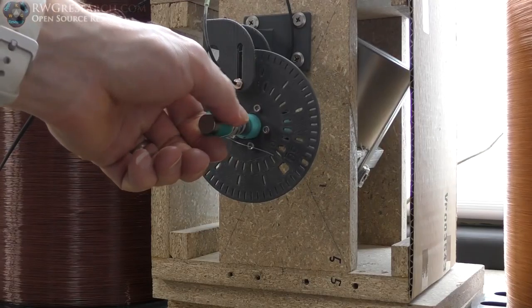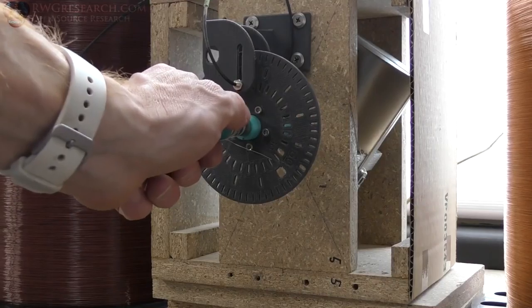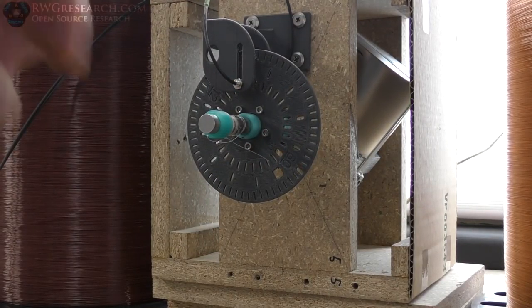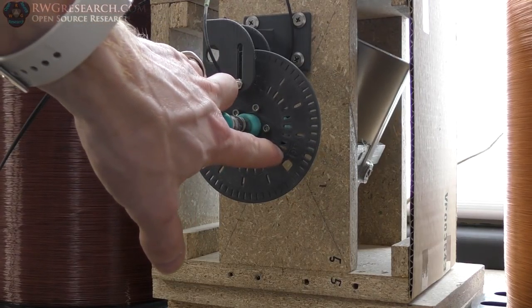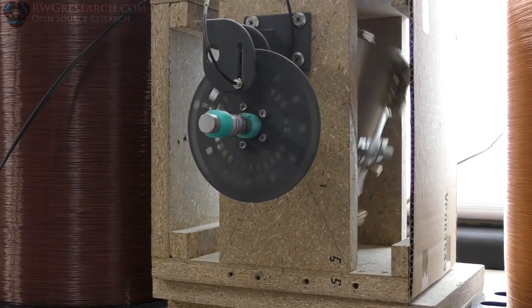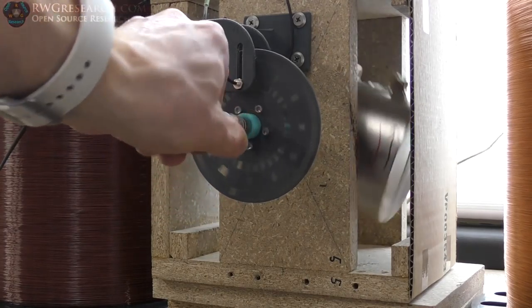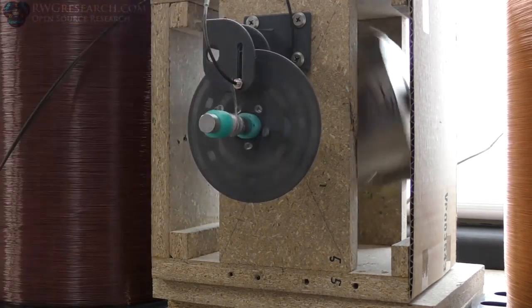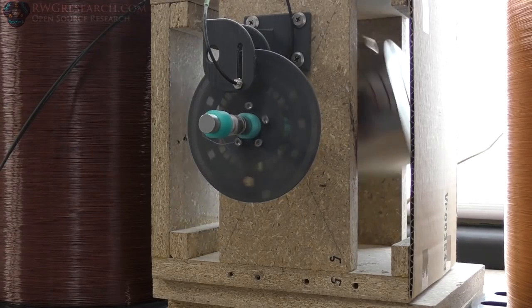Now, the index pulse, as you can see, is right there. There's one for each one, and it's bigger than the rest. If you look at one edge, it's always consistent, and if you look at the other edge, the rising or the falling, then you can find this one edge that's different. So in one direction, all the falling edges are the same, and the rising edges are the same except for that one spot. That way, the index pulse is actually built into the wheel without ever losing track of the pulses.